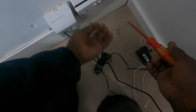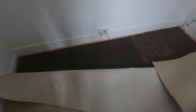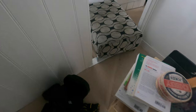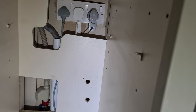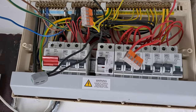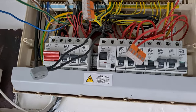Have you got any MCBs in here? No 20s, but they've got 16s. 16 or 20 amps will do. That's only got one cable in, and that one's got three. Which one comes through to this one here tells me there's some sort of connection in the floor, or somewhere else, and that's why you've got this problem. I'm going to put the ring in connectors, and then go check at that socket to see if that's where the break is. If so, I'll just disconnect the neutral and the earth there and make these radial circuits — I think that's the quickest way out of it.